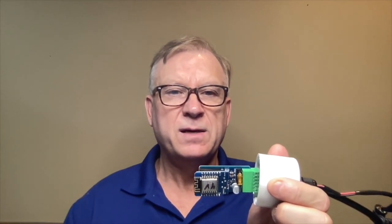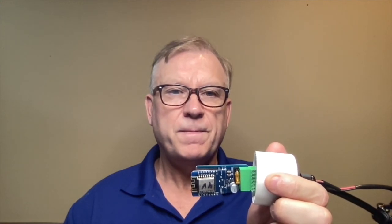Now we've seen how to wire an ES Pixel Stick and a parts list, let's take a look at a finished product. Here's my enclosure. Notice I drilled a hole in the end cap for the cable gland — in this case I used a PG-7 cable gland, which was large enough for my pigtail and power connector. Also notice that I labeled my unit with tape and a permanent marker. Now let's take a look at what's inside — there's really nothing inside other than the wires and the ES Pixel Stick.